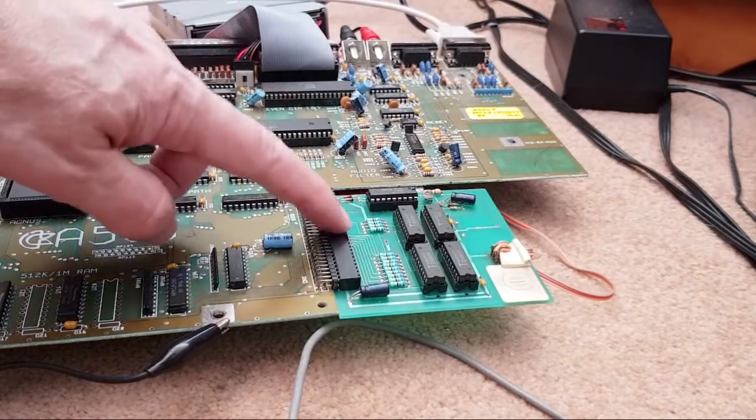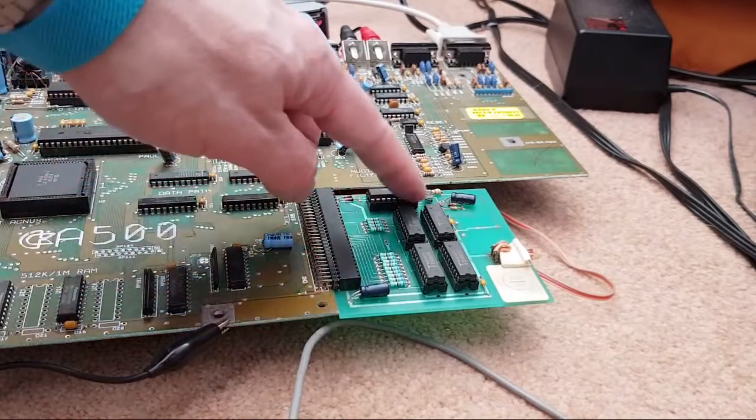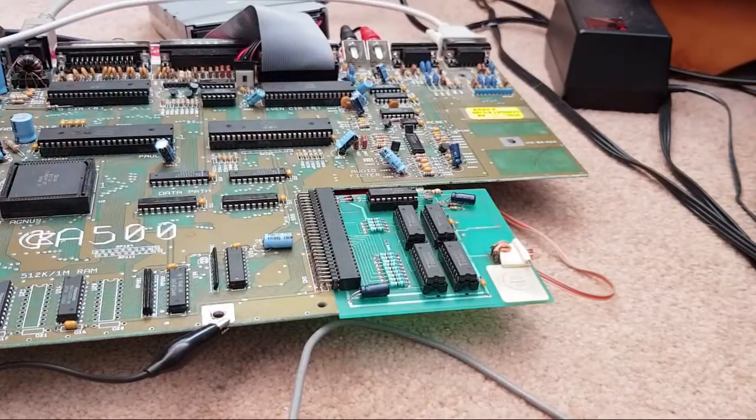The board this would have come out of, the connections here would have been all green and furry at the point where the battery started to leak, probably. That's good, though, because that means all the RAM's all right. No faulty RAM chips. It was just a bad socket, bad trace. This is a classic example of why I hate sockets. Perfectly illustrates why they suck.